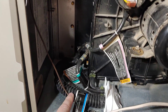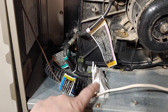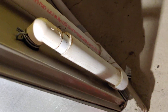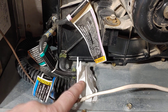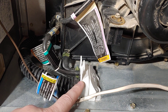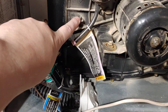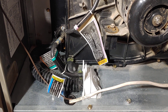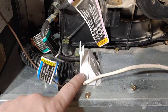When you're inside here, you want to make sure all your tubes are connected. This tube here takes condensation and goes into this white thing, which is in charge of discharging your excess fluids that lead to a drain. I had a problem with my upstairs attic unit — because I have a two-unit system — where this thing was completely clogged with black stuff. It hadn't been cleaned out since '07. There were little rust spots underneath because it filled up with so much water. It would work and then stop working after a minute or two. I had replaced the capacitor on that blower motor as well, but that wasn't the issue — it was this that was clogged.